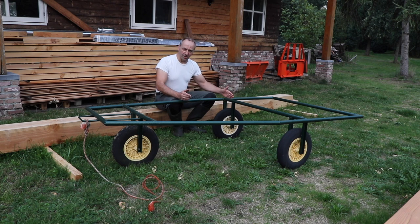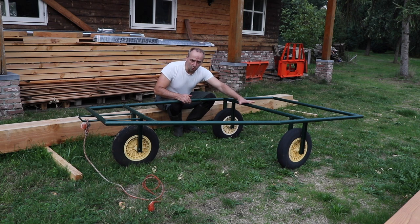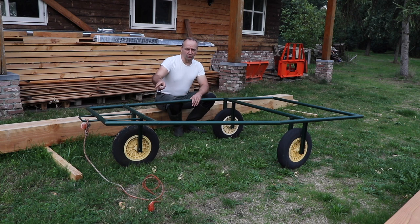The wheels at the back are quite towards the center of the design. Why is that? Because this way you have the center of gravity almost at the location of the center wheels, and that is exactly what you want — it is quite easy to lift the front side in order to steer in a certain direction. That is also why there is only one front wheel, because you only need it for stabilization.